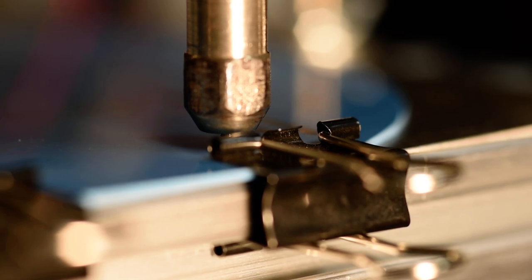This is test number one of 1.6 millimeter diameter copper wire being deposited at 30,000 RPM on DuPont 951 LTCC — it's high-polish, nanometric polish in fact. I am going to be running a surface feed rate of 75 millimeters per minute with an XZ feed ratio of 80.